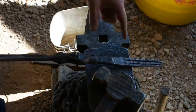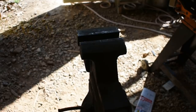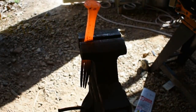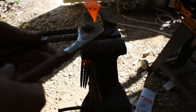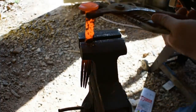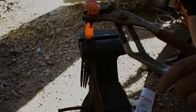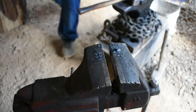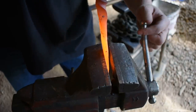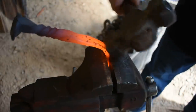Now we're going to take it and heat up the handle, twist it, and then we'll knock our forks over, and then we'll be ready to go. A real easy way to bend these forks over is to come in and measure down about how far you want — I usually try to go about halfway — clamp it in, and then just use your hammer to knock it on over.